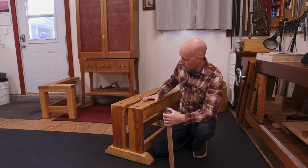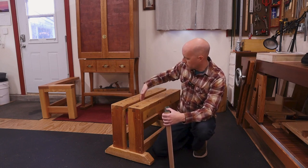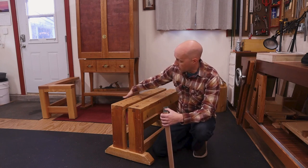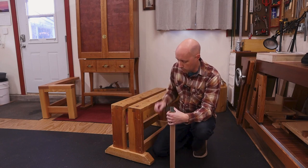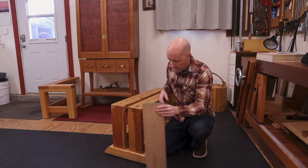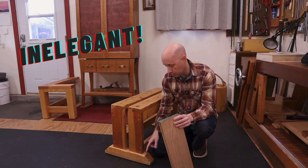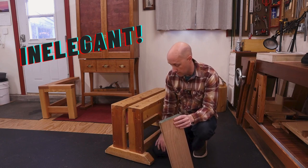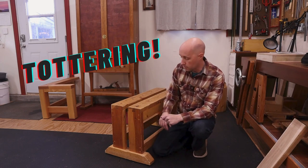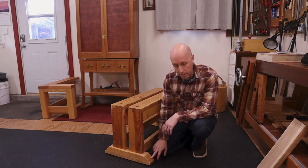Among the issues was that the split top meant if you had a board on top you couldn't always see where the split was, so I ended up sawing into it on occasion and eventually just did my rip cuts on the sides instead. Another issue was these big feet — I didn't end up using the ledge on the end very much, and the feet got in the way a lot. When doing rip cuts down the side of the bench I would chunk the toe of the saw right into the feet over and over again. And every time I walked by I seemed to kick it with my toes and almost wipe out. These feet were just really bothersome.